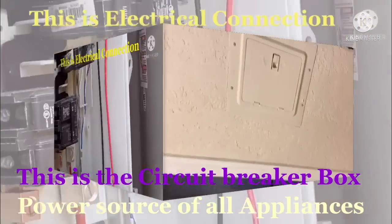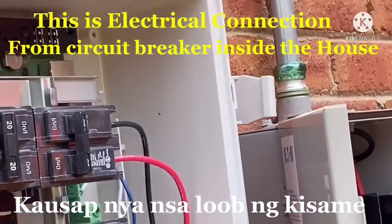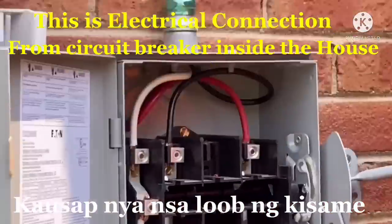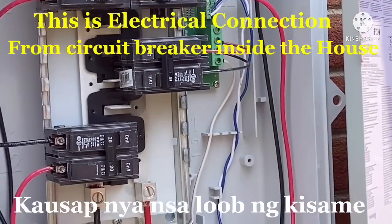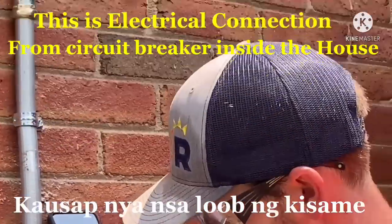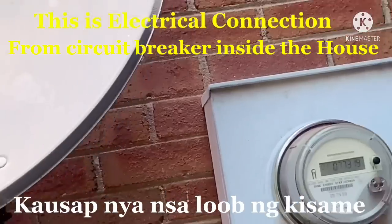Just a jumper, I guess you could call it. But let's just say you have a partial A, another partial A, and then your home run to the inverter A. You would just take those three and put them under a large crimp cap. Okay, that's what I thought.